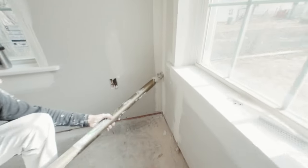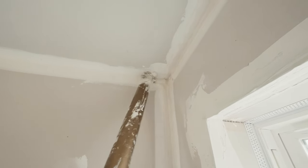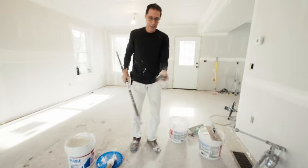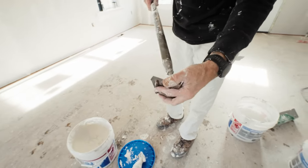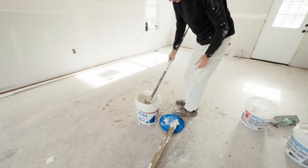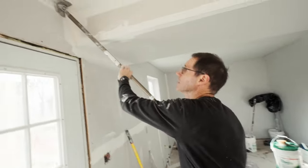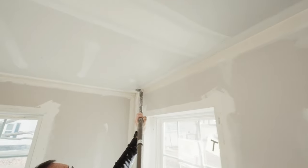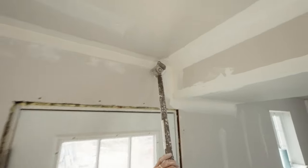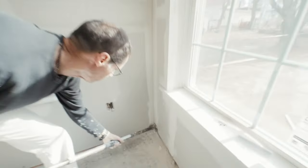I'm going to put some compound on this corner. Now I'm going to attach a corner flusher that's a little bit wider than the one I used yesterday — probably about three-quarters of an inch wider. I put it on and acclimate it by getting a little compound on it. I usually go over every one of them twice, so I'll pull it all the way to that edge and then go back and do it again. I like to start at the bottom and push up — it's just nice and clean.